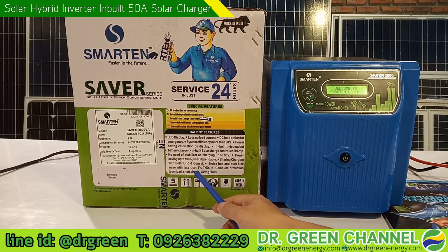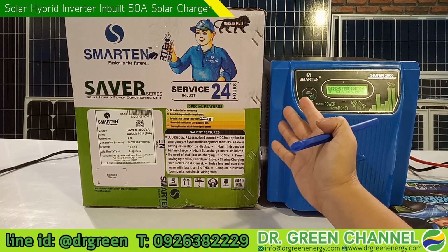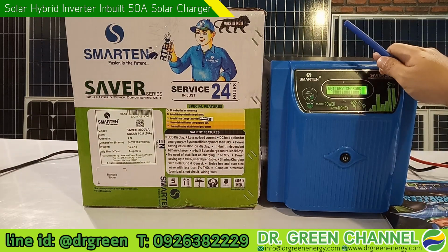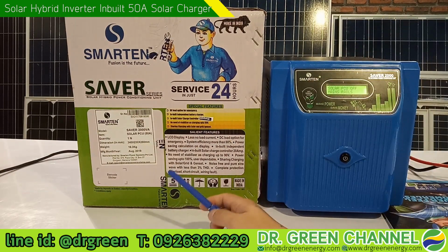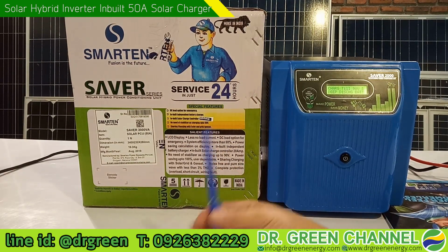Noise free and pure sine wave with less than 3% total harmonic distortion, so very good pure sine wave output. Complete protection: this is also designed with many safety features, as we will discuss here. The first one is overload protection. Once you use an appliance that overloads, overcurrent, this will cut off and also come with an alarm. Short circuit protection, and also wiring fault protection, which will appear in the alarm.